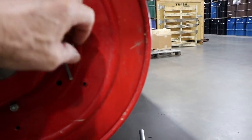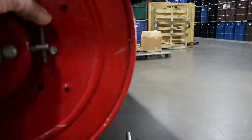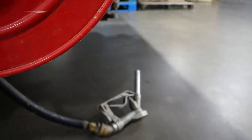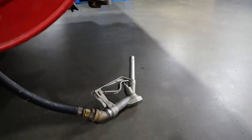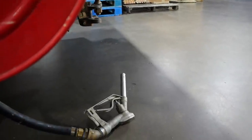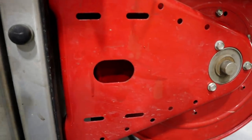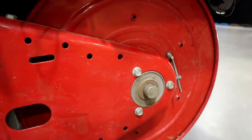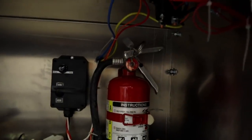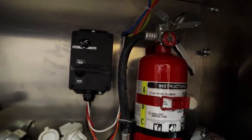The reel has a little lock on it that you can release so it'll swivel easy. We keep it locked going down the road — we don't want that hose coming out. The nozzle just hooks up on a little hook on the truck frame. I have a button here for the electric, and inside the toolbox we have a rheostat and a solenoid that handles all the electricity.